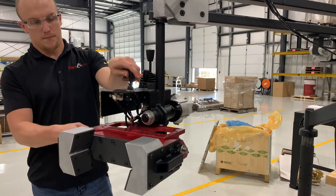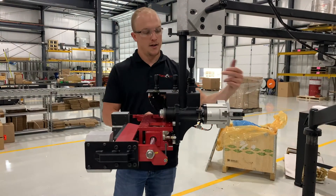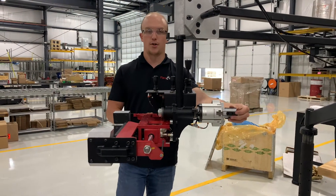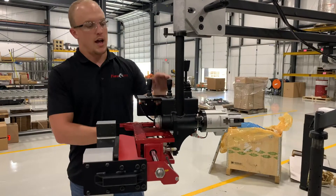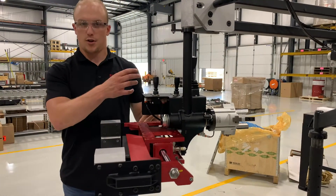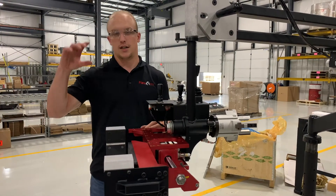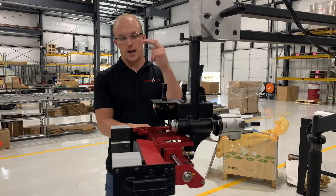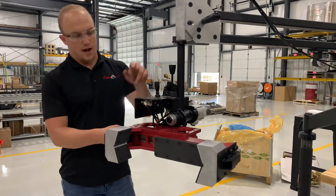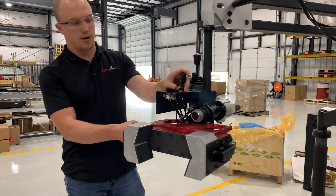When we're loading the round part into the machine, we're going to be picking it up with this gripper, which grips on the ID of the part. Then during the machining cycle, there's a sub spindle that comes over and grabs that part in the lathe, brings it over to the other side of the machine, does its operations. So when we unload, we'll have to use this gripper to grab on to the outside diameter of the part.